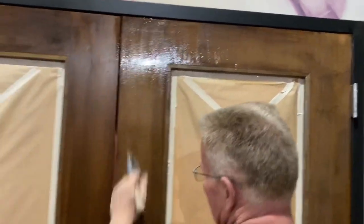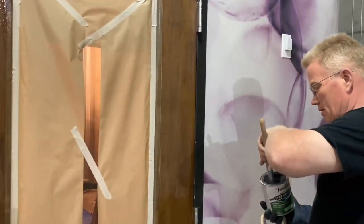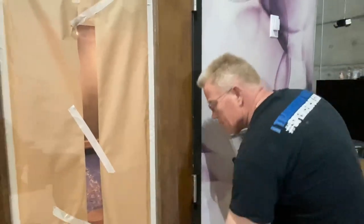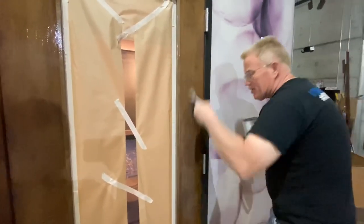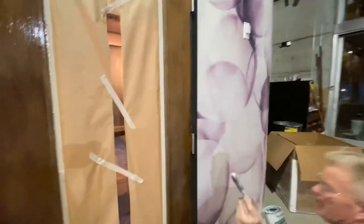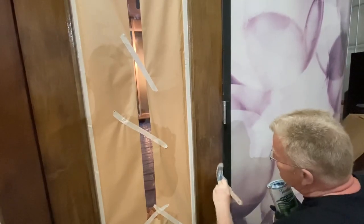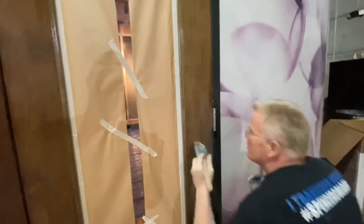You can see the grain is obviously up and down all around. You want to apply it evenly, and some of the same rules by which you paint are applied when you stain and also finish off with a clear coat. The brush that you use has to be a good quality synthetic brush.